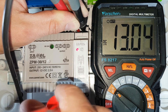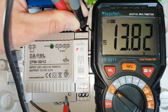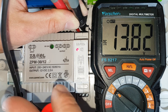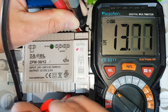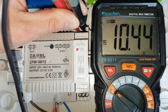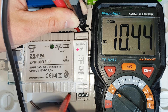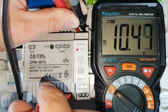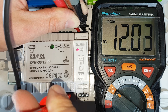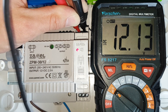To make a correction of the output voltage, the ADJ rotary potentiometer needs to be turned. The multimeter indicates the voltage changes at the power supply output. It was possible to set the voltage at 13.82 volt level. By reducing, the power supply voltage managed to descend to the level of 10.43 volt. The nominal voltage was then set at 12.13 volt. Such settings allow adaptation of ZPM power supplies for various applications, and also eliminate power losses occurring in installations with longer connection cables.